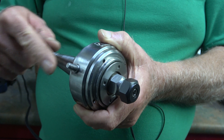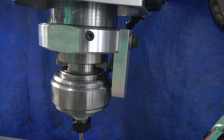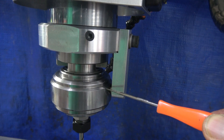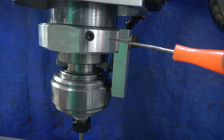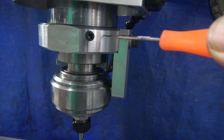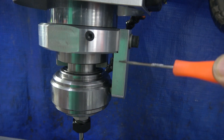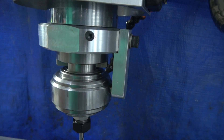What you're seeing here now is the unit fitted into the spindle. To stop the outer part rotating, instead of the long handle which I haven't got, I've manufactured this aluminium ring which is clamped onto the spindle bearing locking ring. It also has a part down here with a slot in the bottom to stop this section rotating.